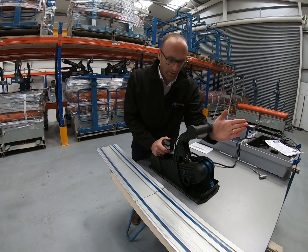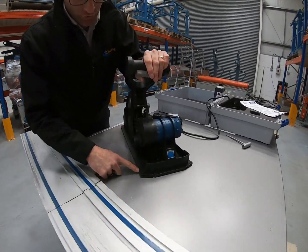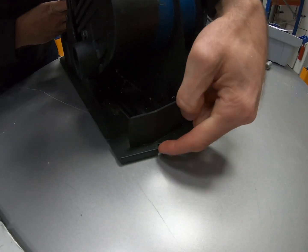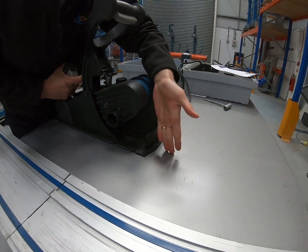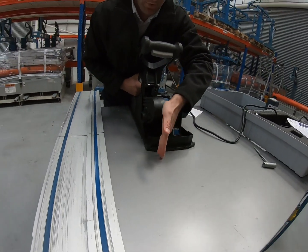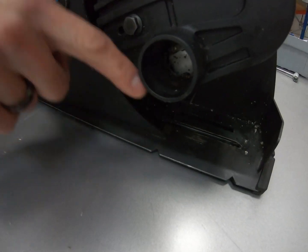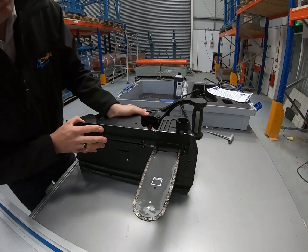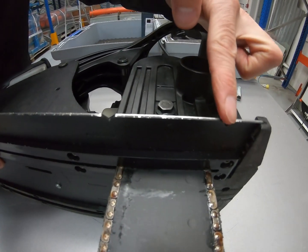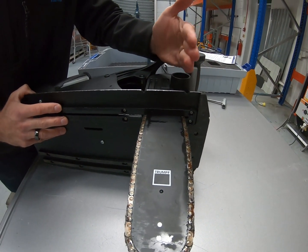You can draw lines on the panel if you want. On the panel cutter you'll see small notches — this notch here is the line that the blade takes, so any line you draw on the panel should match up with that. The two notches relate to when the blade is plunged fully down, showing one side of the blade and the other — the saw will only cut as far as these notches indicate.